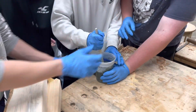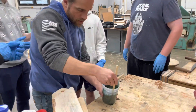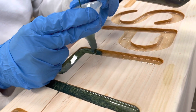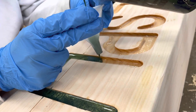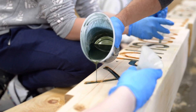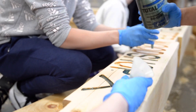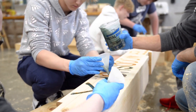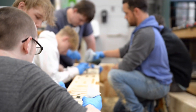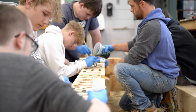It was neat to use both the Shaper Origin and epoxy — two things you may not immediately see tying into timber framing. Shout out to Jess Crow as well, who helped me figure out the best process to pour the epoxy into the lettering. We did this at one of the pavilions at Maker Camp a couple years ago. Jess suggested pouring a thin primary layer of clear epoxy first to seal the bottom of the letters, then mixing in the green resin and pouring separately on top — and the letters turned out beautifully because they didn't run.